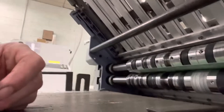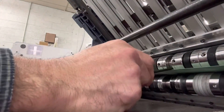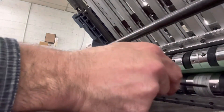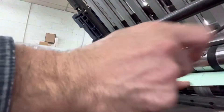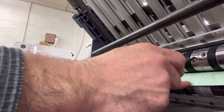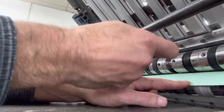I'm going to see if I can do this and give an explanation for what I'm doing. First thing I've done is gone through and loosened all the screws. I've got a piece here that I've drawn a line on — I cut a piece over the cutter at my 3.666 and then drew a pencil line, so I'm setting this cutter just to the waste side, trying to hit the edge where that piece of paper was.